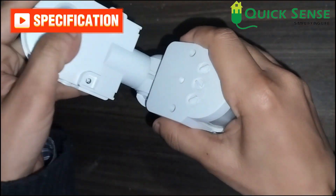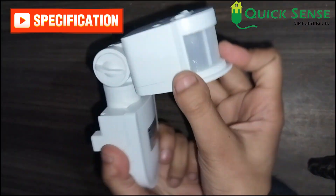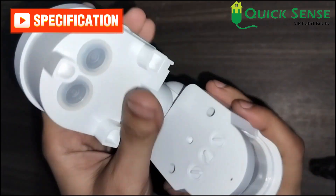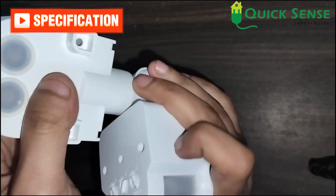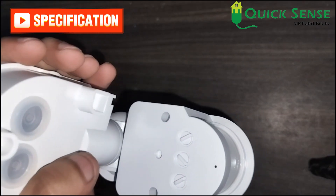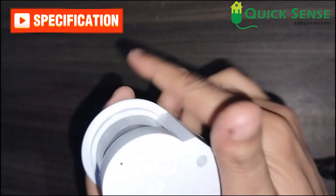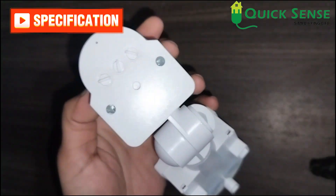You can adjust this from this side to this side easily. You can also adjust it along this side on the wall to detect motion. This is a 180-degree wall mount type, so the detection range is 180 degrees from this sensor and it is adjustable. There are three knobs on this PIR sensor — the sense knob lets you adjust the sensitivity and detection distance.